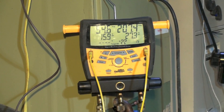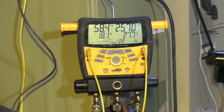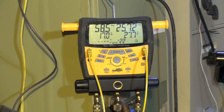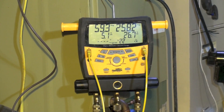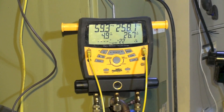Let's add a little bit more charge to see what happens. I want you to look at these pressures right now — ignore the subcool because it's exceedingly high; watch the superheat. Less than a minute later, take a look at that superheat again. This is a heat pump running in heat mode. We're at 5 degrees superheat — actually 4.9. Let's see what happens as we watch.